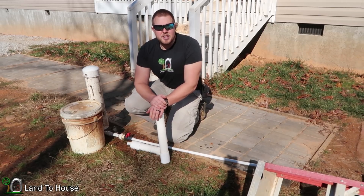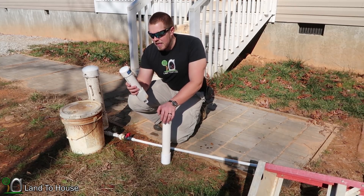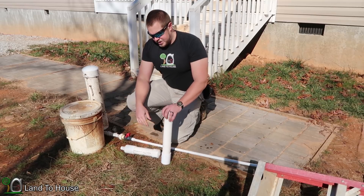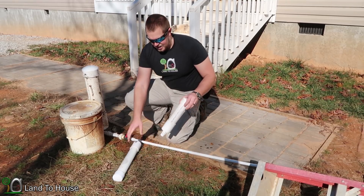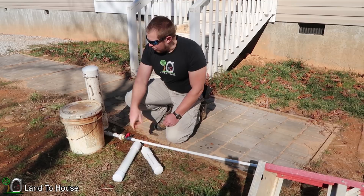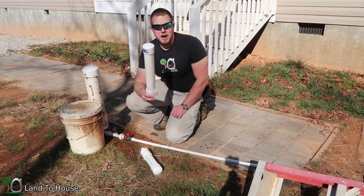So when people ask the question, does the pressure tank size matter? If it's too big, it's going to take forever to prime and to build up the pressure that you want. And if the tank is too small, yes it does prime quick and builds pressure, but there's also not a lot of volume to keep the pump going when you release the delivery pipe valve. You want a pressure tank that is going to be in the middle — big enough to allow you to open the delivery pipe and let some water out. For instance, if you had a hill only 20 feet high and you open that delivery ball valve, that water is going to be sucked out pretty quick and may stop the pump if the tank is too small. Whereas if it's too big, sure it's going to suck some water out but it's still going to be working. So I would err on the side of too big versus too small, and if you can, right in the middle is a good size.